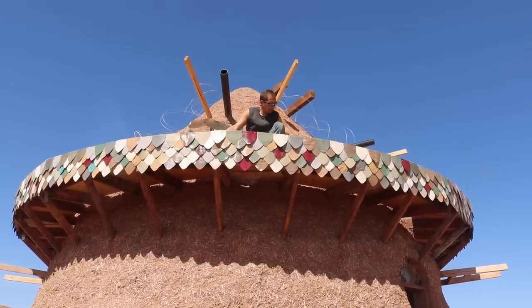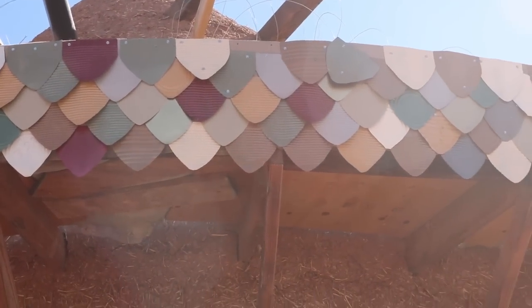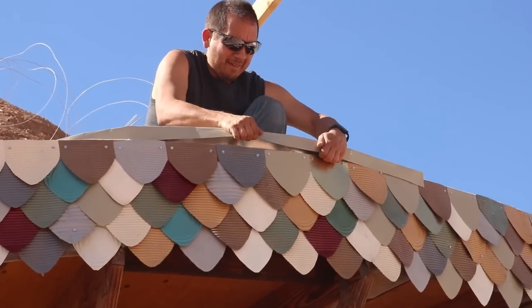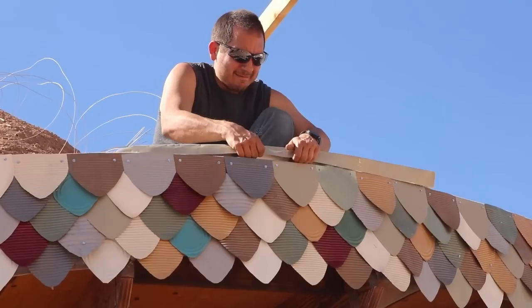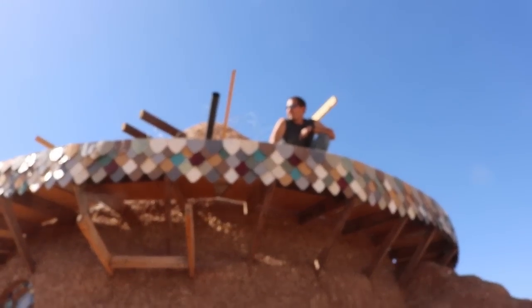Well y'all, I think I messed up. Big time. I need a ridge cap up there ASAP. We've been getting some strong winds and it has been blowing the shingles off of the eaves - basically everything on that top row. I feel like if I can get this ridge cap in place and secure, these shingles will be rock solid. But until I can do that, these shingles are subject to getting pulled off. I thought having a nice tight crease would clamp it down more securely and look nicer, but putting such a sharp crease in that metal has made it a lot weaker at that crease spot, and when I try un-flexing it, it's tearing in some places.